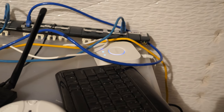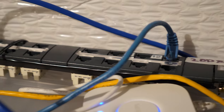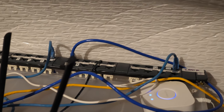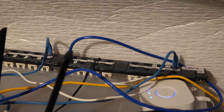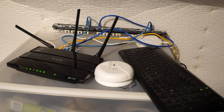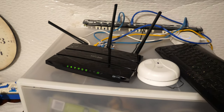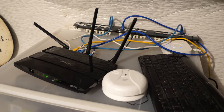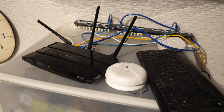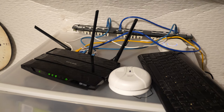One thing connected here is the Philips Hue hub, which controls all the smart Wi-Fi light globes, and behind that I've got what's called a patch panel — the other end of all the different Ethernet ports across the house. At the moment I'm only using three of them, but I've run about 12 to 16 ports to different places in the house, allowing me to hardwire things that either I don't want on Wi-Fi or that don't even support Wi-Fi. The Archer C7 provides Wi-Fi across the whole house from a central attic location, but I do want to upgrade to a multiple access point system, as the 5GHz signal doesn't reach everywhere and we're getting more and more devices — Nest cameras, smart switches, TVs, phones and tablets.